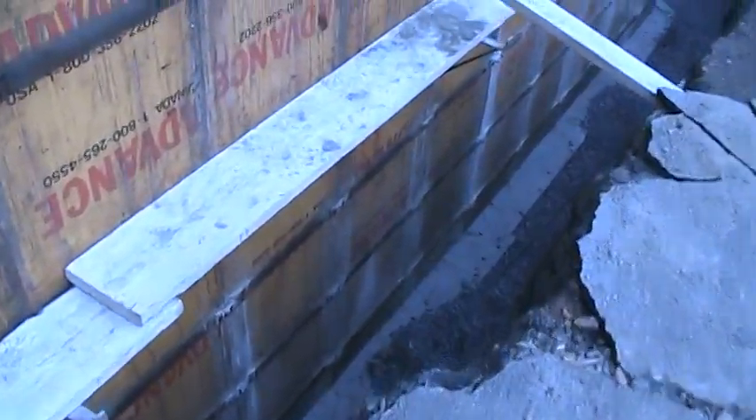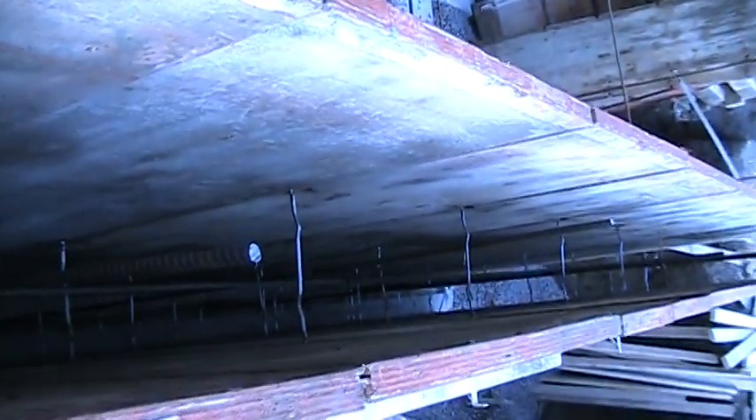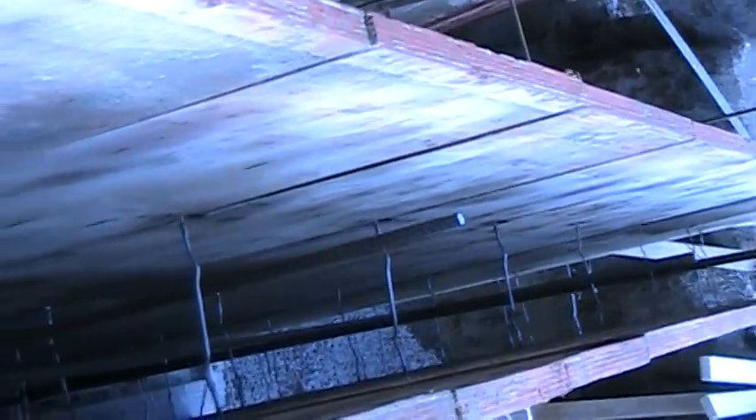There's a little plank here where you can see the rebars. I'll see if I can zoom in. So you have three horizontal bars — the top bar isn't placed yet — and every four feet you have a vertical bar. These are all number five bars, except between the window opening and where the beam will rest.